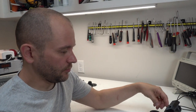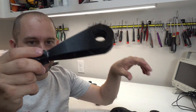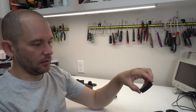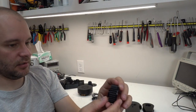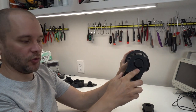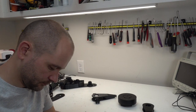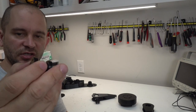The current legs for the Quad A1 are composed of a few parts. The first is the upper leg, and there's a lower leg which is three separate parts: a 3D printed part, another 3D printed part, and a squash ball with foam. There's a pulley that attaches into the lower leg and slides into the notch. There is an upper pulley which goes onto the QDD100 and fits into the motor, and then also there is an axle that goes in the center of that lower leg pulley, which is just a machined aluminum bracket.